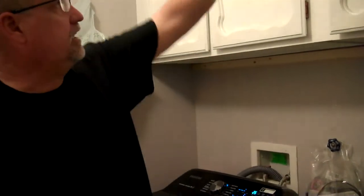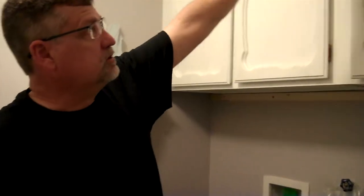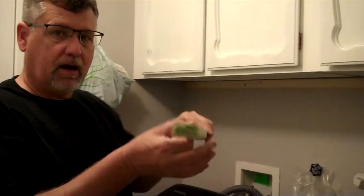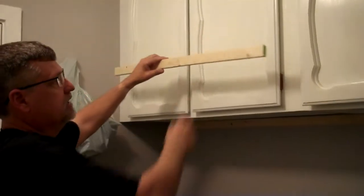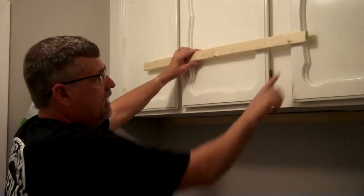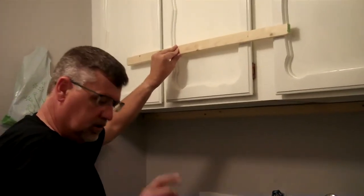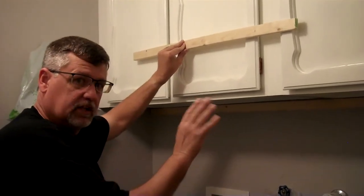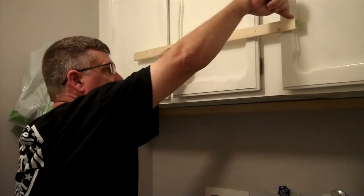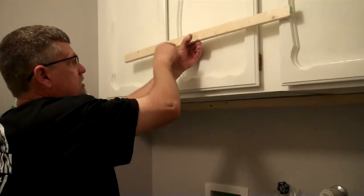So what you're going to have to do is cut the sheetrock out in that spot. Don't use a sheetrock saw. Use a razor blade, because you don't know what's behind there. If you use a saw, you could hit a PVC pipe or an electric cord. So once you expose those studs, take a 2x4 and lay it sideways in between those studs, even with the front face of the stud, and just pre-drill a couple of holes at angles to toenail using nice long, not your cabinet screws, but just a long standard Phillips screw, and screw that 2x4 in the corners to fit in between the existing 2x4s so that you have some place to screw your cabinet into.